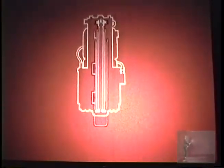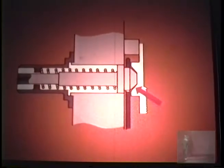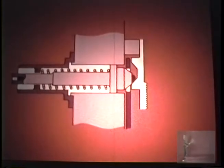When the sear is pulled, the firing mechanism ignites the primary cartridge. Gas pressure fills the inner barrel and begins to drive it upward. As it rises the first half inch, the plunger is forced out by the chamfered portion of the breech, unlocking the seat from the outer barrel. The breech contacts the seat upper cross beam and begins to lift the seat. Further movement forces the plunger out of the safety latch in the outer barrel until it is fully disengaged and the seat is free to be driven up the rails.